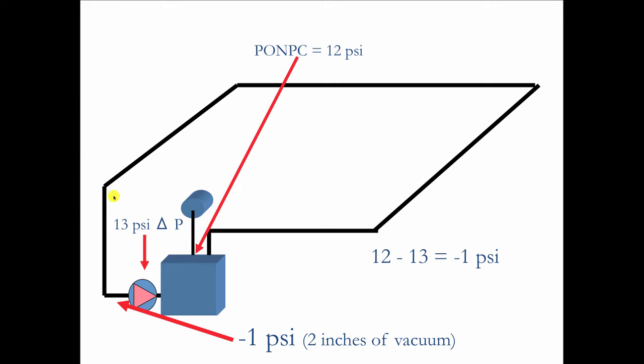And also, if this is a high point and somebody installs an automatic air vent there, well, air is going to go into the system right through that automatic air vent because it'll be subatmospheric. So air comes flooding through here, hits the boiler, rots the boiler, and gets spit out of an air separator on the supply side. And this was the tragedy that they were facing in the 60s before they moved those circulators to the supply, pumping away from the compression tank.